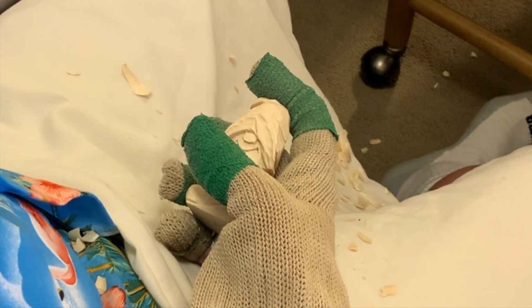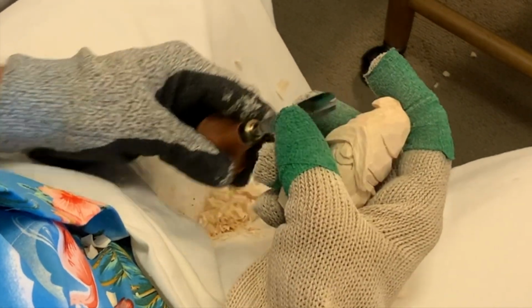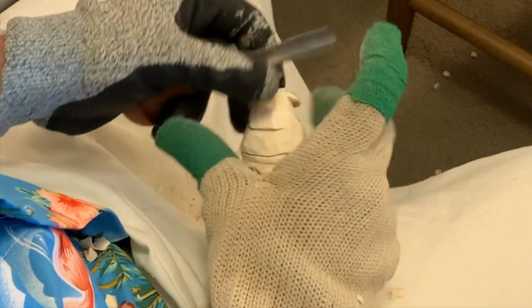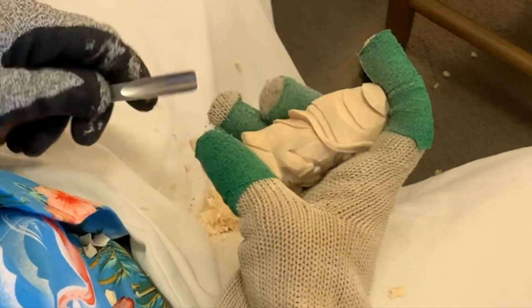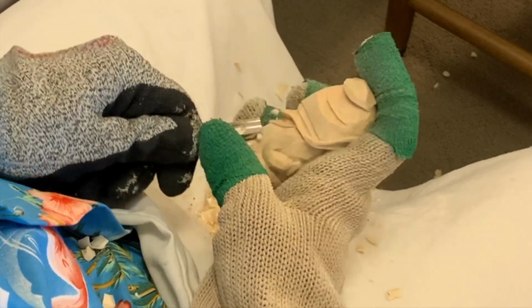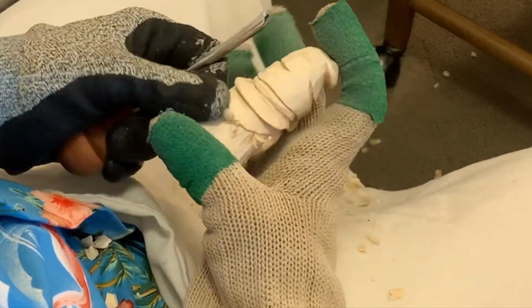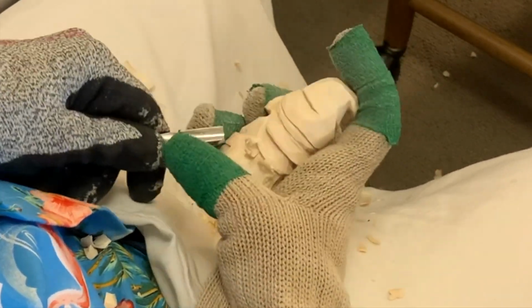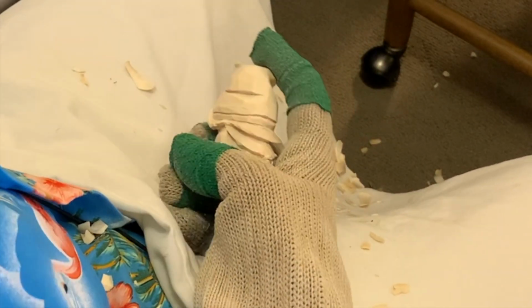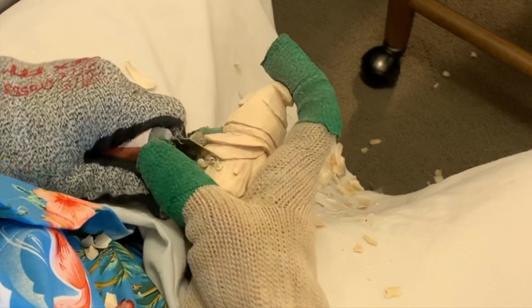So we used our number three gouge. Up next, I'm going to switch over to my number nine. This has more of a sweep to it, right? It's a number nine. This is a 10 millimeter Swiss made. Again, we'll use it on the coat some. And this will give us some interest, some gouge marks that will add to the texture of that coat.